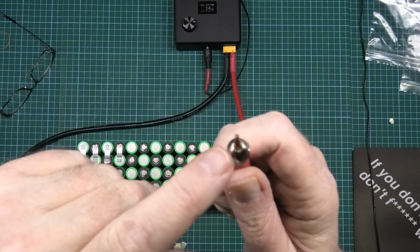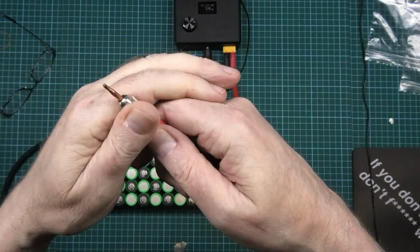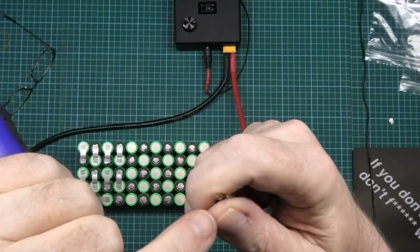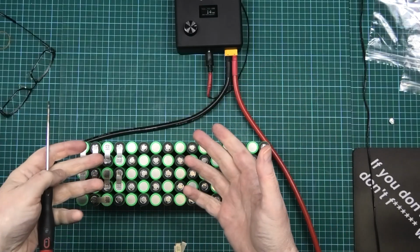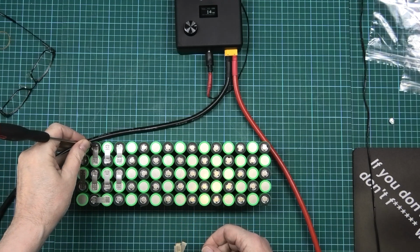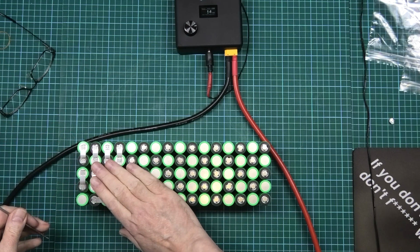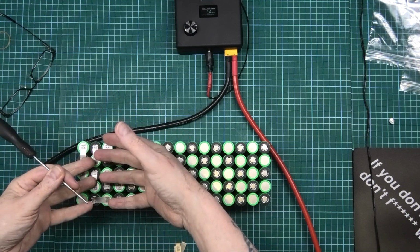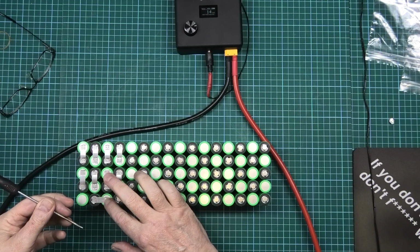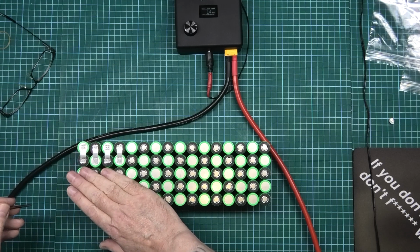Now also what I do, while they're cooling down, is I clean the tip. I mean, the tip itself's cold now, but this bit is still warm. But I just get a file and I back file just to clean all the crap off the end. Now the other thing I do while it's all cooling down, to give you a bit of time to do other things, is I get a screwdriver and I bend down the positive tabs. That's purely so you've got nothing sticking up anywhere. You want to keep as much internal as you can. And also I go over everything to make sure that, like, I can feel a bit of a lip on that, I make sure that's completely flat. Just get your screwdriver and poke it down a bit. You don't want anything sticking out at all.